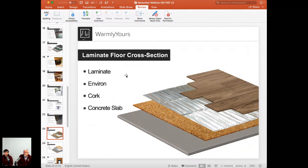We want to make sure that that cold lead that is 1/4 of an inch thick is not going to create any sort of bump, any sort of uneven section on the floor. So the trick to that is just cut out a nice channel in the cork. It's 1/4 of an inch, run that cold lead through it. Flooring is going to lay down on that nice and flat without any sort of issue.